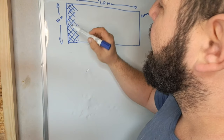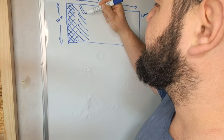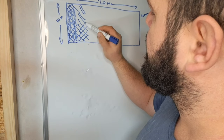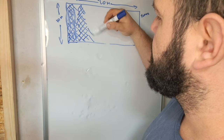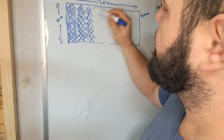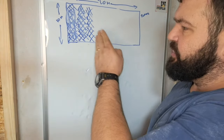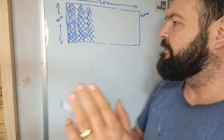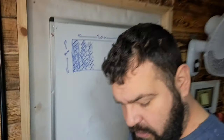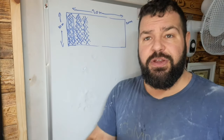For a monster ceiling, say 10 meters by 20 meters - a 200 square meter ceiling - you want to go into typewriter method. Work your way down the ceiling in stages: take your first big stretch back, first coat that section, then second coat that section, then come back down like a typewriter and first coat the next section. Flatten that, second coat it - you understand the system. That way you work all the way to the other end of the ceiling. The little joints between each stage don't mind - it'll all blend into one. This way I've put on monster ceilings completely on my own.